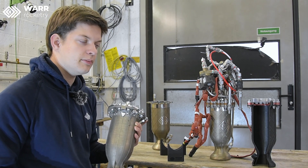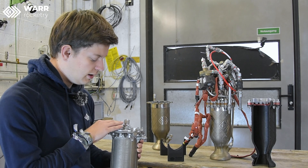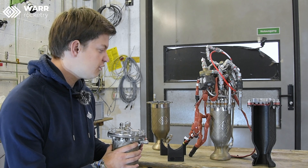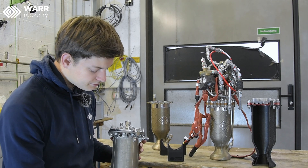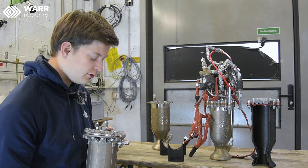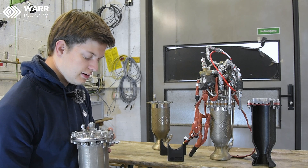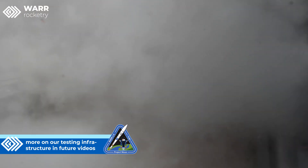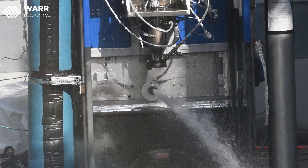The principle is the same as with Rota. In this generation, the injector was partly mounted inside the chamber, while on newer generations it's a flange design on top. We changed that for sealing reasons because this way it's easier to seal. This was the very first regeneratively cooled chamber we built in Project Nixus, and we also tested it a lot. We did a lot of hot fires on the test rig and also wanted to fly this chamber last year at EuRoC, but unfortunately that didn't work out, so this baby sadly never flew.